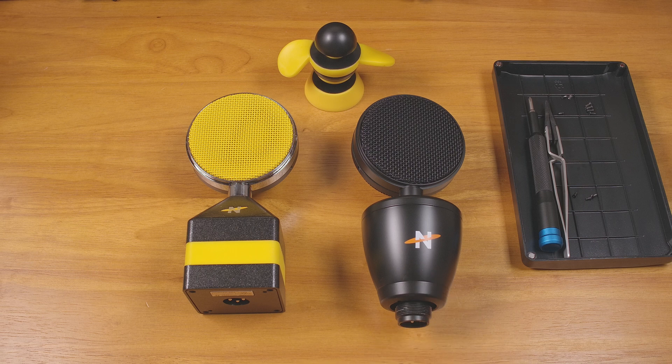So I thought it would be interesting to do something a little different for this video. Typically a microphone comparison is all about sound, but I thought it would be fun to actually open these microphones up and see how they compare and differ. I also wanted to see if there was any likely culprit that could cause a hum, potentially a ground issue. Sound Speeds had a hum that came and went when he tapped on the microphone, which sounds like an intermittent ground issue, so I was curious to see what the inside of this mic looks like.